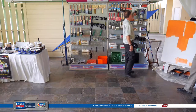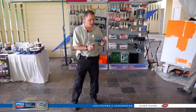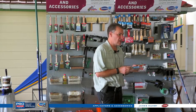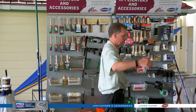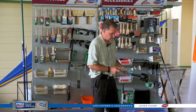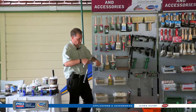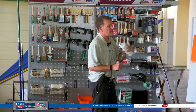Let's talk about what you put the rollers on — your cage frames. You might wonder why this has a double bow in it. We came up with this idea well over 20 years ago. What it does is grip your roller. Many of you have had a roller start to skid off the frame as you're rolling up and down the wall. This is designed to grab the roller very snugly, which avoids that whole issue of the roller sliding off the cage.